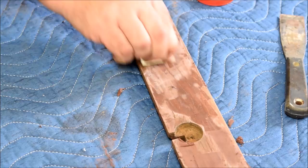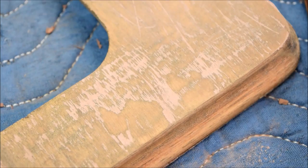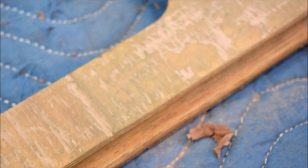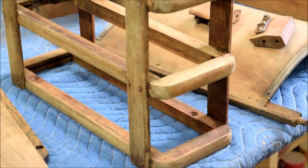We'll set that aside to dry and then we'll sand it again — it'll work, I promise. There's how the timber mate filler fills those tears in the wood and the scratches. I think some of it might have been a bad aggressive sanding job at one point — I really just don't know. But you can see all those repairs that we had to make so that we get a smooth finish here.